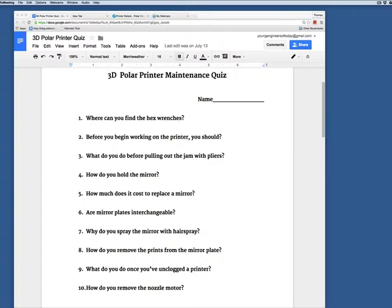Because there's three reasons a 3D printer fails, in my opinion. Just my simplistic answer. One, the surface doesn't have good adhesion. Two, it doesn't have the right temperature. Three, it's not level. Well, we just got rid of level. So now I just have to worry about the temperature, and did I put on enough hairspray? And now that PLA is coming in carbon fiber, conductive and magnetic, there's no reason not to be using PLA. All right, any other questions on this?